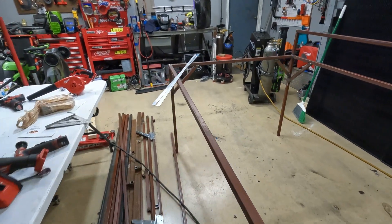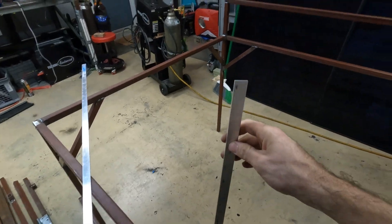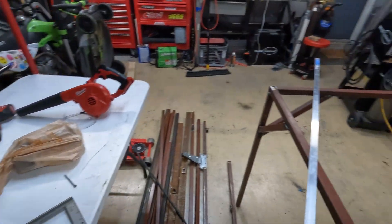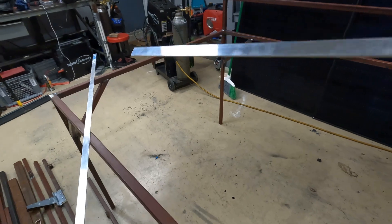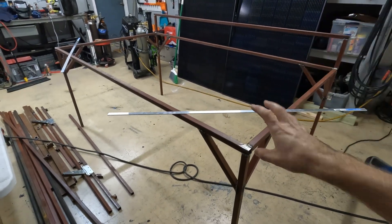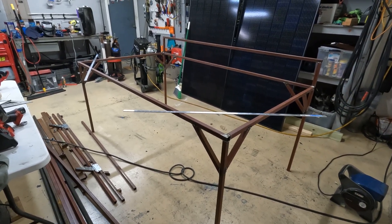All the welding is done. I went ahead and bought some aluminum strip — the idea is to cut these into small pieces, put two holes in each one, and this will create a sandwich with the solar panel's aluminum frame. We're going to put two bolts to clamp it to the frame and clamp it to the back part. I also bought some paint. I'm going to rough this thing up with a scotch pad, paint it, throw the panels on, and it'll be pretty much done. Simple is key here — you don't want to put in a ton of effort, especially if you're not sure how your design will go. I'm really happy with this design and it doesn't cost a ton of money in materials — only took a few hours.